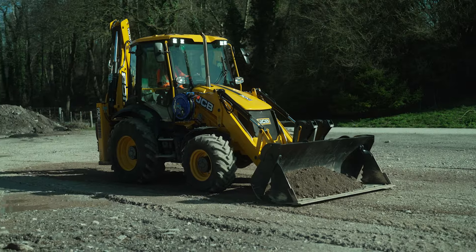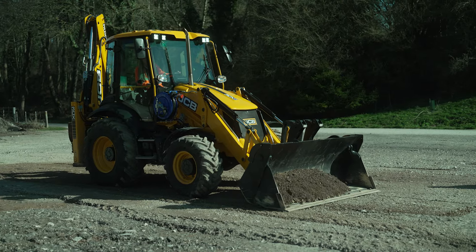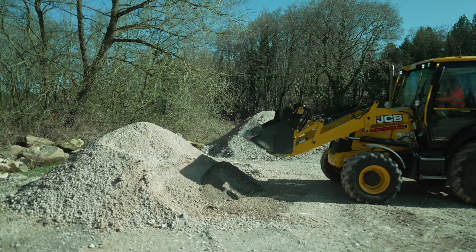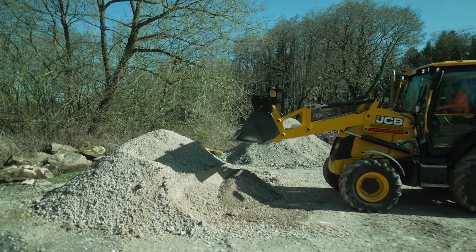At the end of the run, or when the shovel is full, close the clamshell fully and crowd back the shovel. Tip away the stripped material and repeat as required.